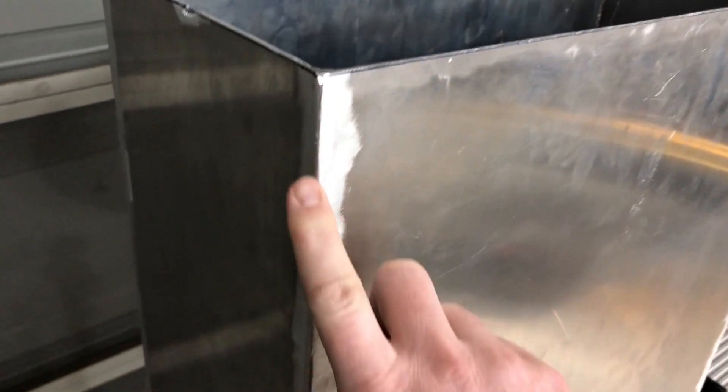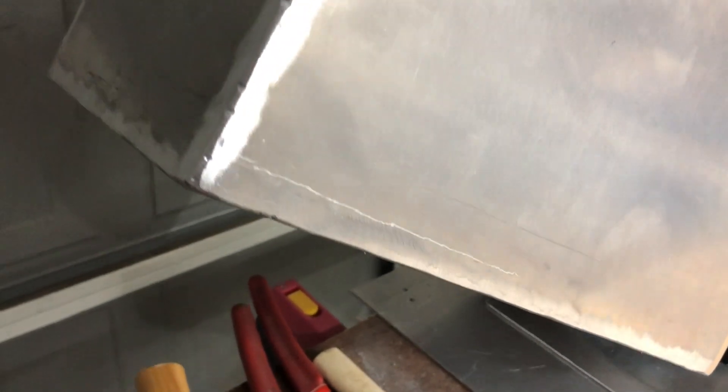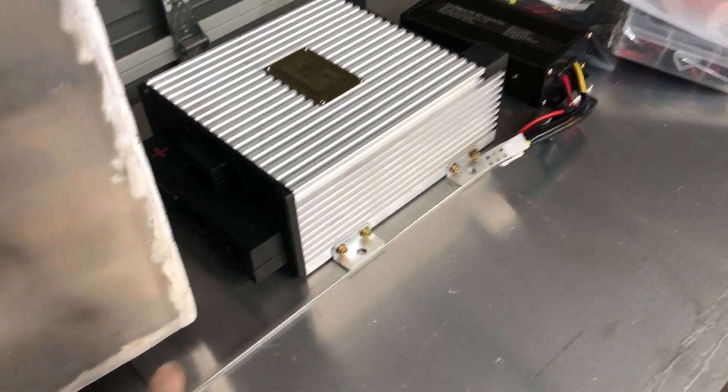Full update: I've got this box fully welded up, corners all done, and I ground off on each edge. You can see it has good penetration — each of the corners is showing full depth all the way through. When I ground it down, there were no sections that gave me any concern about lack of penetration. It's welded on all but one side, so five sides are welded, and the top is going to be a plate.